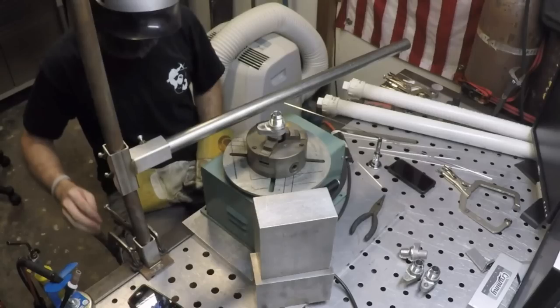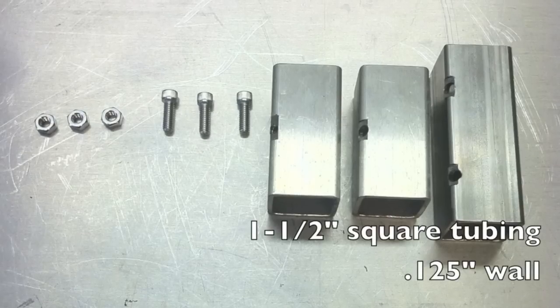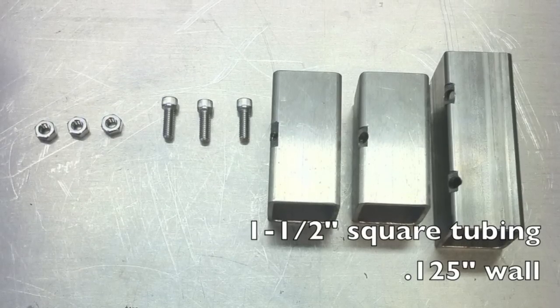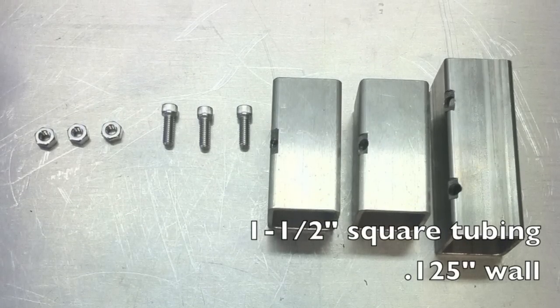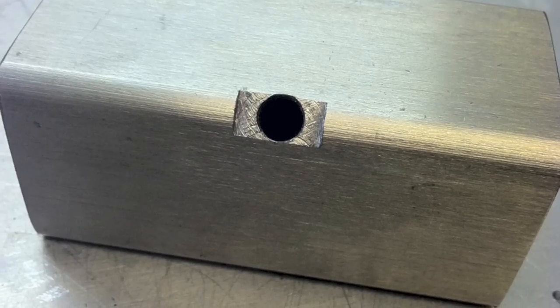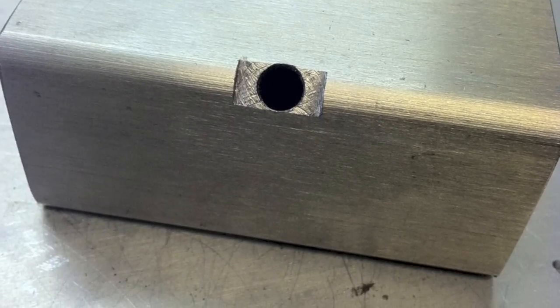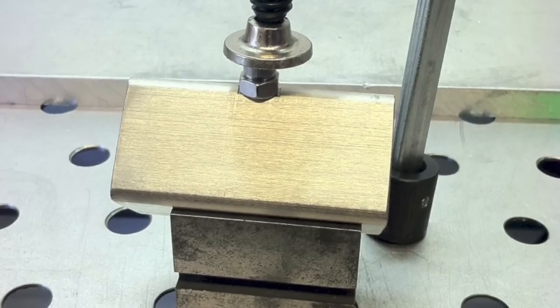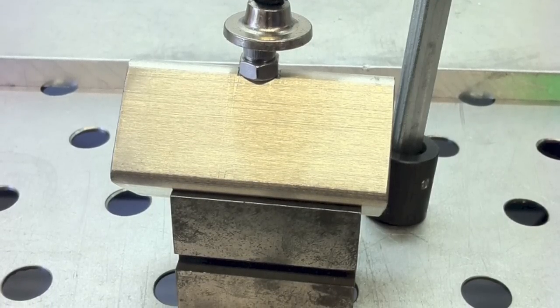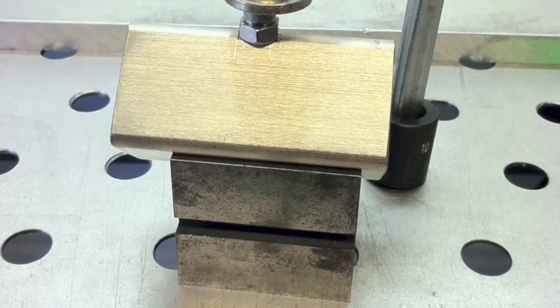Let's look at how Roy built his prop if you're into making something like this yourself. You can use it on a turntable or you can use it on long runs to make that long horizontal glide. Roy used inch and a half square tubing, eighth inch wall, milled a little flat spot where he drilled the hole to weld nuts on. There's not really enough material to get much thread on if you're wanting to use a tap, so he just welded nuts on.